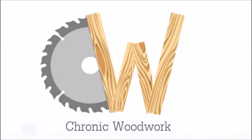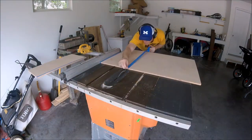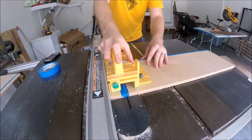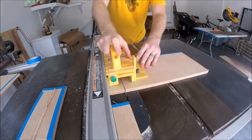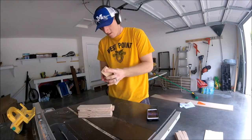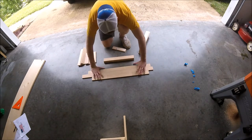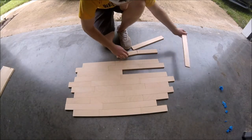To create the basketball court feel, I purchased a half-inch sheet of the highest quality birch plywood I could find at my big box store. I cut it into strips of varying sizes — some were 12 inch, some were 18, and some were 9 — and then I ripped each of those into 2-inch strips. I used some blue painter's tape to minimize tear-out at the table saw, but I still had to do some sanding on all the edges. I laid all these pieces out on the ground and found the rough shape I wanted, then moved some pieces around to create seams between the boards.